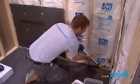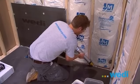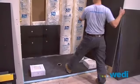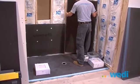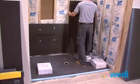Once your wallboards are installed, it's a good idea to trowel back the sealant from seams. The sealant starts to cure in about 30 to 60 minutes, depending on temperature. Continue the process of filling the base channel and install the wallboards. Place the washers over the seam between the boards to encourage a flush transition while using fewer fasteners.